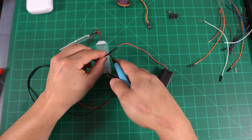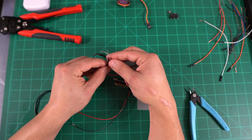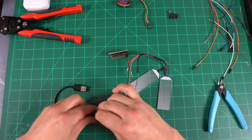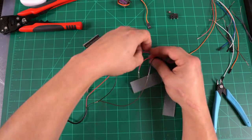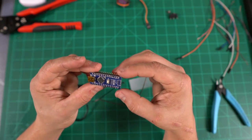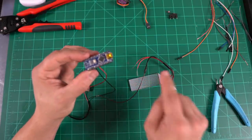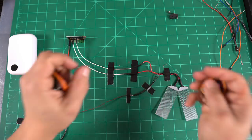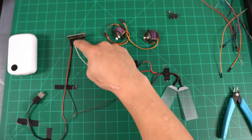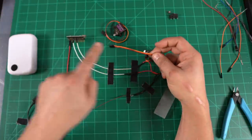Next, let's hook up the LEDs to the Arduino. Cut off the battery pack from the LED set. What's cool about making circuits like this is that all the grounds can be connected together — the pin outs on the board power it with positive 5 volts, but all the grounds or negatives can share one connection. Looking at the diagram, pins D3 and D6 are for the LEDs. On the Arduino itself, flip it around and look for D3 and D6 — that's where we hook up each eye. One's for left, one's for right.